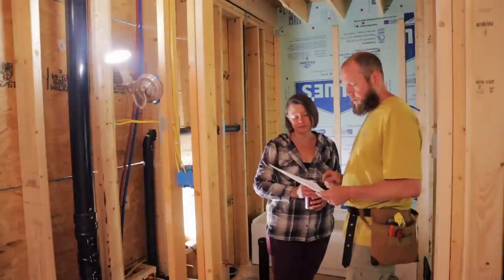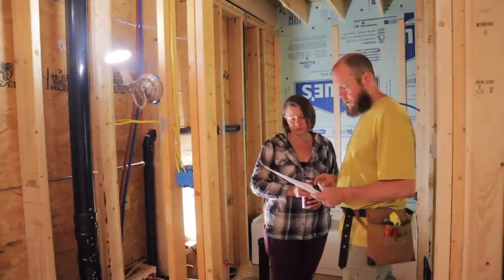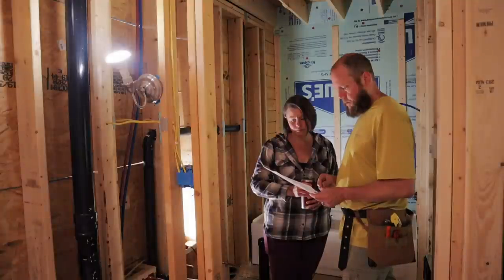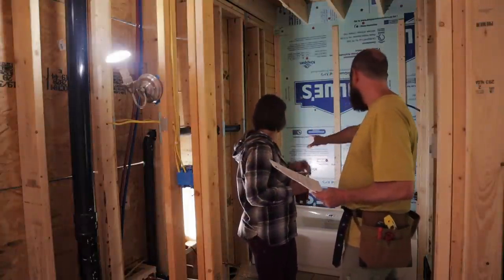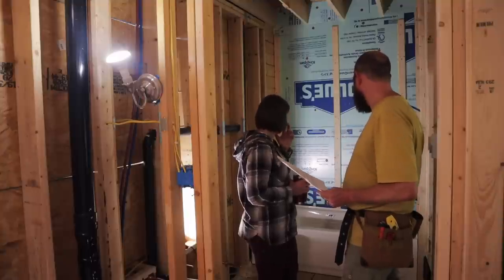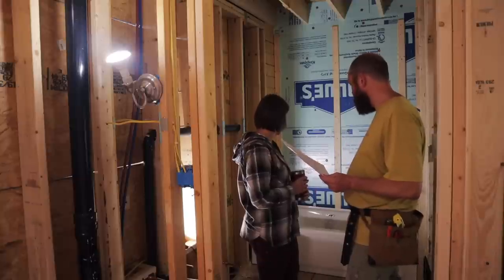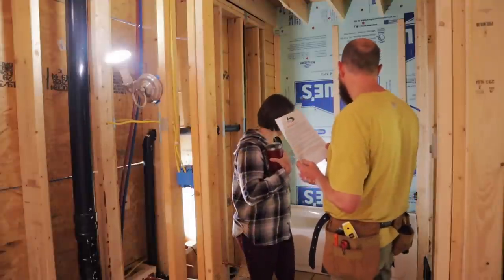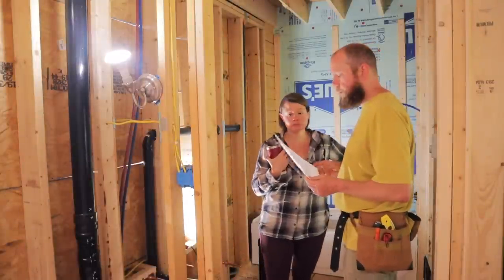Last week Ryan and I actually brought the bathtub in and set it down in its space in the bathroom. But we now know we need to go back, make sure it's level, and do some extra things to make sure it's all installed correctly. So we're going to be doing that today. We temporarily put the fixture in place, made sure it's supported, and marked the joist so a 2x4 can be nailed in place. We're going to put a mark across there so we can put a 2x4 against that back wall for support. But first we need to put a level on it and see if it's leveled the way it sits right now.